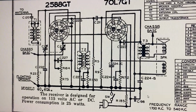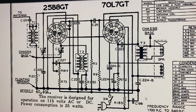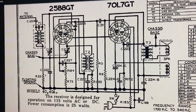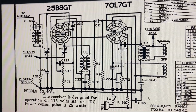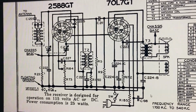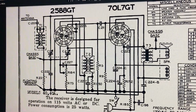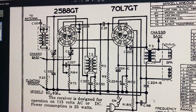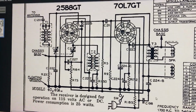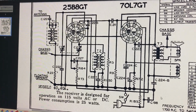So maybe I'm wrong and they do have AVC in there, but I don't think so. From what I understand, that's how a radio acts if it doesn't have AVC. That strong channel is a clear channel station that's 4 miles from the house. So it's 50,000 watts, 4 channels, 4 miles away. And so it just overbears everything. If you don't have AVC, it's so freaking loud because it's getting the signal out of my teeth. It can't get the other channels. They're just too quiet, you know.